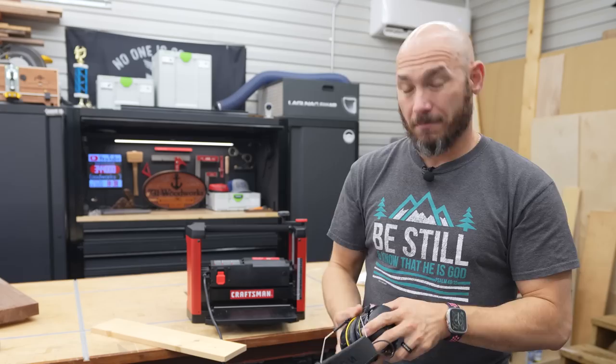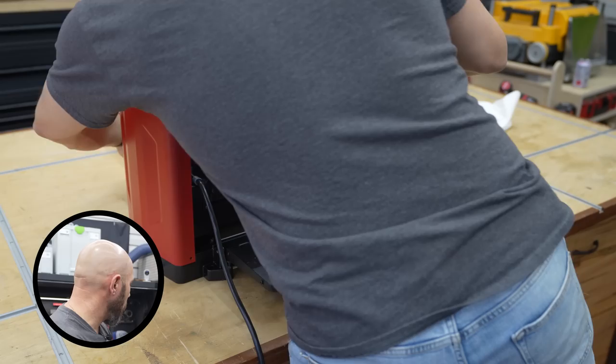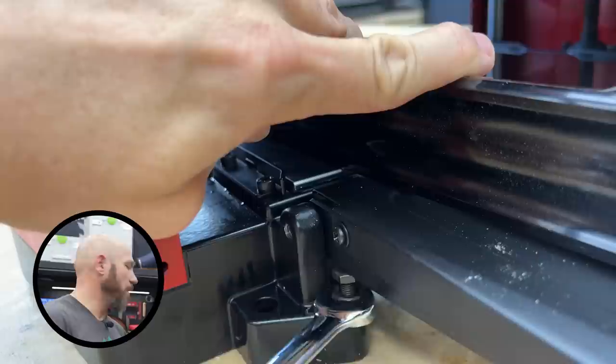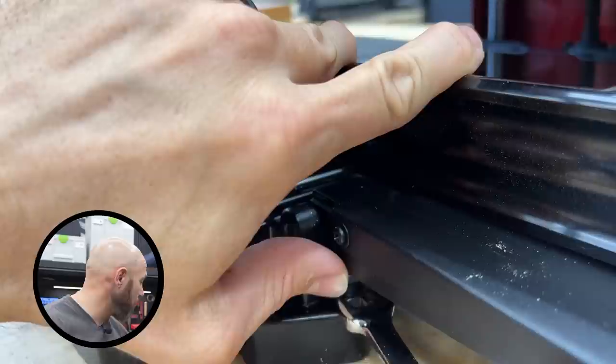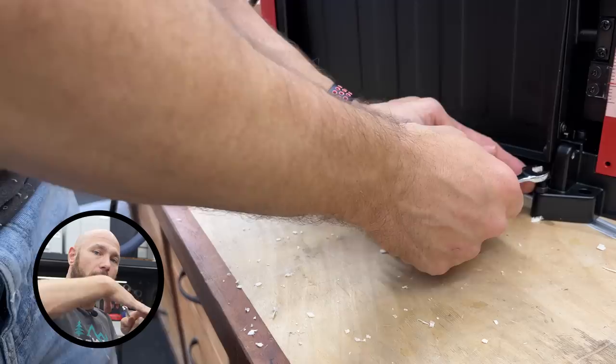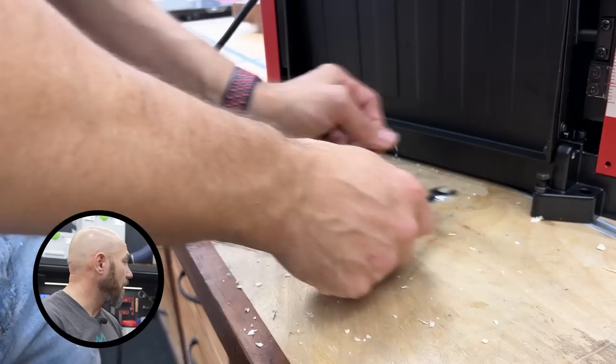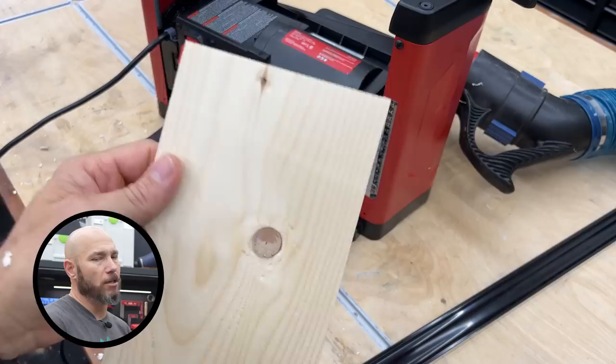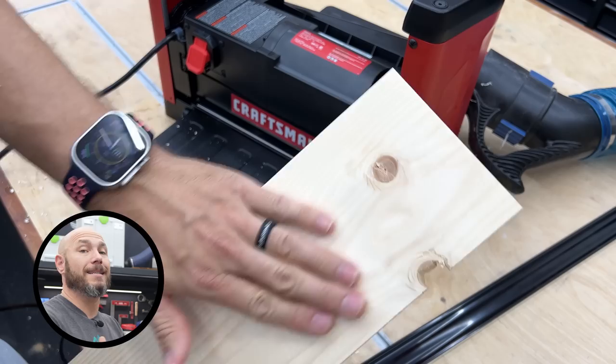The first thing I did was plane a piece of spruce — it's a really soft wood. The first pass did have a pretty good bit of snipe. I wasn't too concerned because I knew we could adjust those tables, so I tightened and loosened those bolts to raise the table. It's kicked up about an eighth inch higher on the backside than the actual bed — that raises the board up so as it goes through, the rollers pull it back flat. I have my DeWalt set up the same way, and it works extremely well. After a few passes I was able to get the snipe almost gone, which is pretty much what I expected. You're going to have a little — it's extremely difficult to totally eliminate it, but I can sand that off and you'll never know it was there.